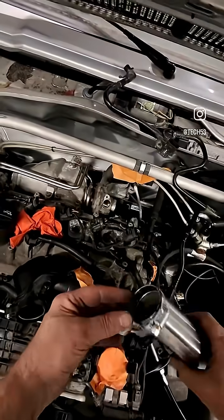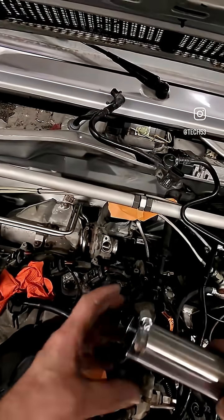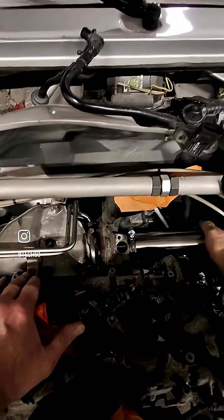Had to do two more grooves because it was too rigid for it to start deforming and for the collet to clamp on the spigot. Oh yeah! I can shake the car — I guess that's a good sign.